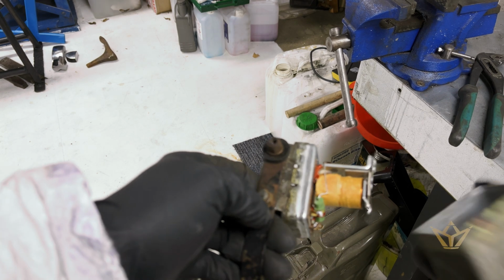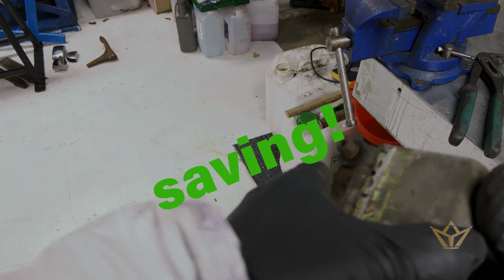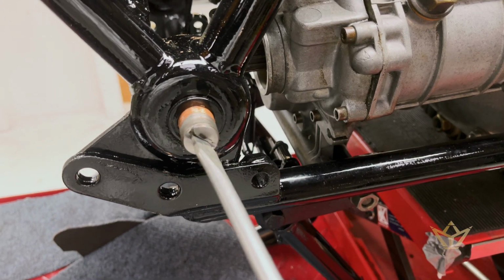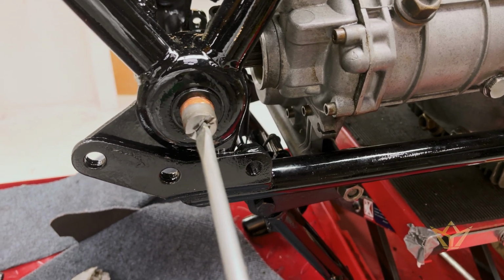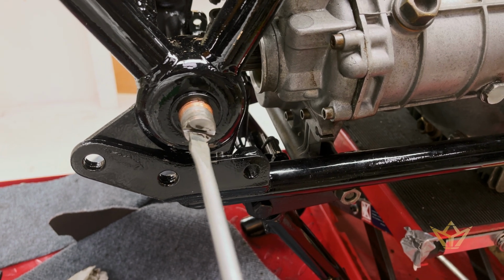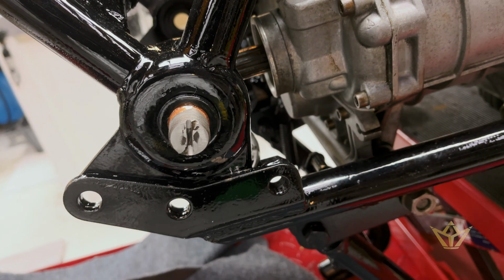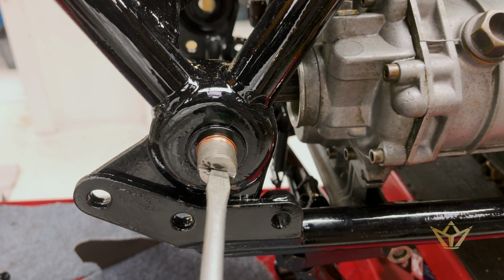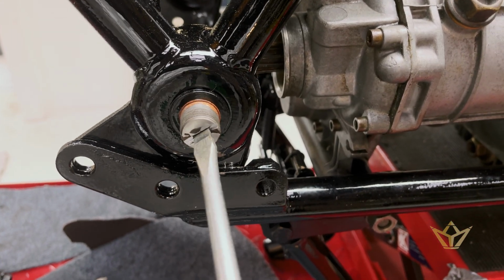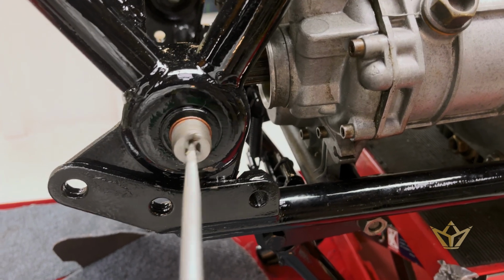Like I said many times, not much on this bike hasn't been damaged in some way. If you remember from the previous videos that I'd done, this was a real nightmare to open. So I've cleaned it up. I've increased the groove on these adjuster screws, and I've put copper slip down the thread just to make this a lot better.